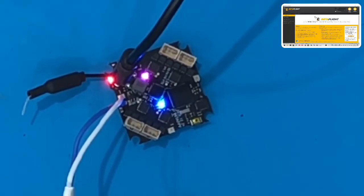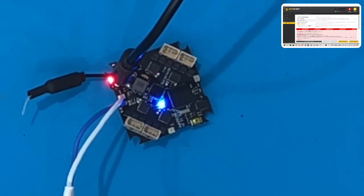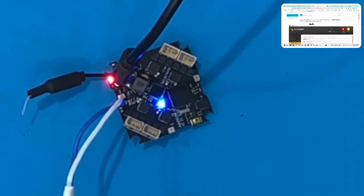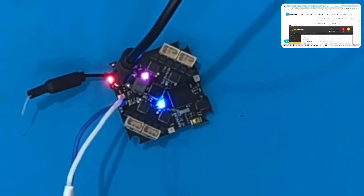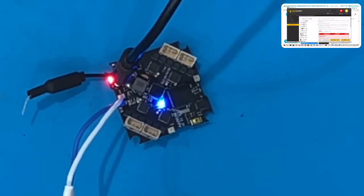A lot of people are doing this because you would think that if Beta FPV has this on their site and they're using the same board — so if you go to their board page the links basically lead to blank pages. What we're going to do is go back to Betaflight and tell it not to use Beta FPV firmware, because even though they make the board they didn't make firmware that made any sense for this thing. Go to Matek — Matek F411 RX. Thank you Matek for doing it right.